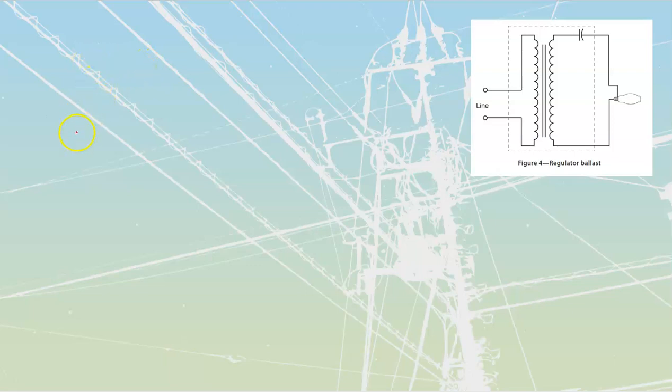Series lighting circuits are going to have what we call constant current circuits, where we are going to have a supply, and we're going to send it out at a super high value of voltage, because we know that anytime that I've got resistances in series, they're going to drop an equivalent amount of voltage across each one. So I can send out a massive amount of voltage, ridiculously high value voltage, to a whole pile of loads, and I can split it down equally, if the loads are equal, onto an equal amount.